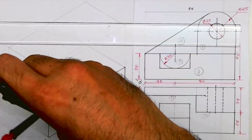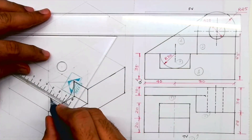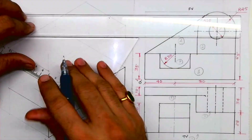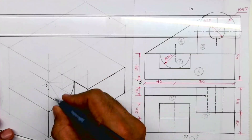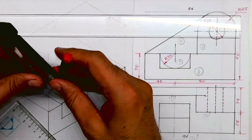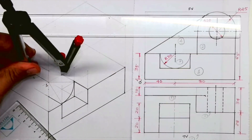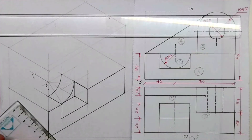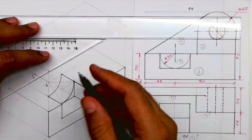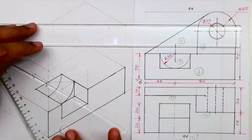The hidden part we won't be drawing. We are done with the front part. Now we need to take this part behind by 20. I'll take this point and mark it as one dash, go behind by 20. Then I'll take this radius and from one dash draw the arc. These lines will be dark. We are done with part three.